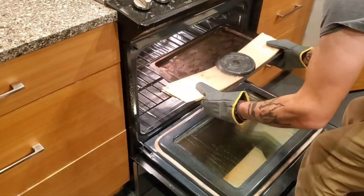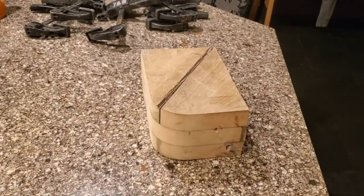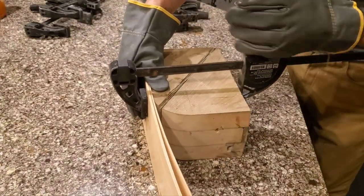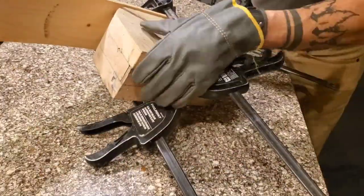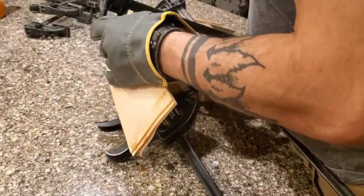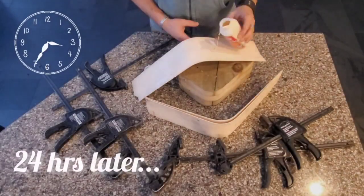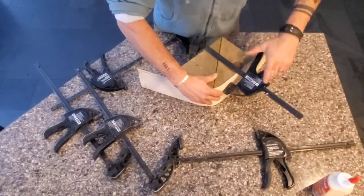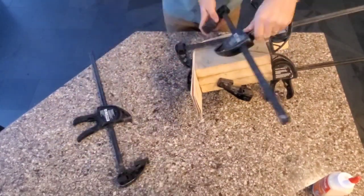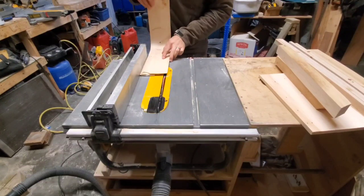The combination of heat and moisture definitely did the trick. Those sheets are very flexible and pliable, and before they cooled down I clamped them on a jig. I let this dry overnight before removing the clamps, and even though it did take on the shape of the curve, there was still a little bit of spring back — which is not a big deal since the glue-up will take care of that. I could then cut the piece to size on the table saw and install it with the rest of the panels.